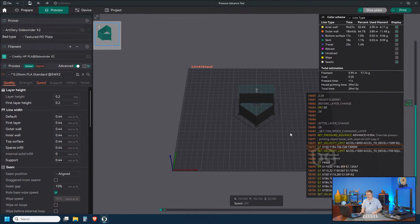So there's instructions on the Klipper website to show exactly how to do this and how to do the math, and what scripts you need to input, and it even gives you this STL. But it's built into Orca Slicer, and you don't even have to measure and do all the math, because you could look at your G-code preview here, and it tells you at what height it changes. So it's the easy way, doing the tower. You could do the little pattern and look at it that way, and it gives you numbers, but it's a little bit more difficult to see. It's faster, only like a 6-minute print. I find that's a good way to get a ballpark, and then you could use this to really fine tune it. You could change your settings when you first start it.